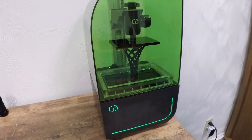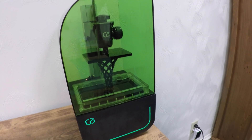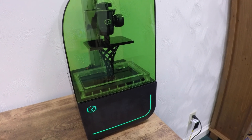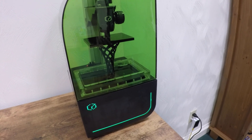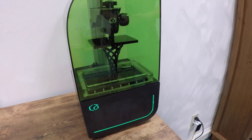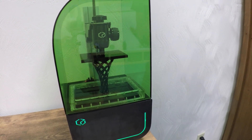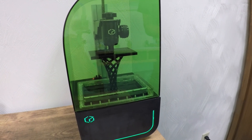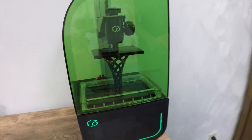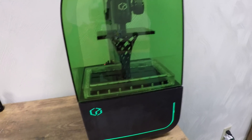So tell me a little about this printer. It looks like it's a resin printer, right? Yes, it's a resin printer and you've got an object printing right now in a VAT. And that's a drum type of VAT, modified with our PSP technology. So when the separation force is higher, the VAT would start peeling from inside toward outside — that allows users to print a greater variety of different parts than traditional drum VAT designs.